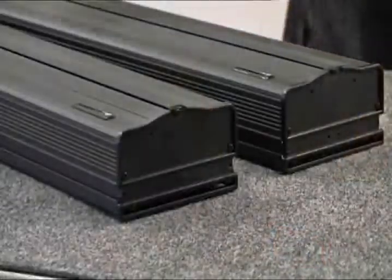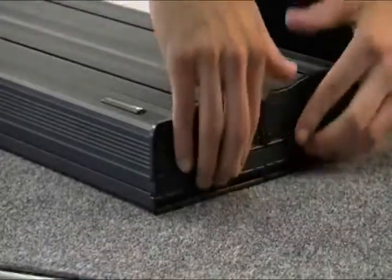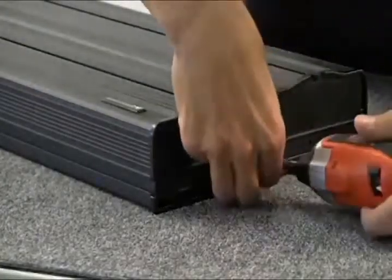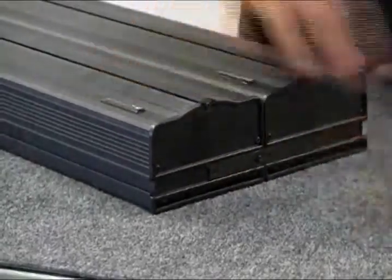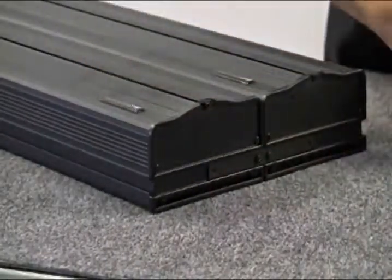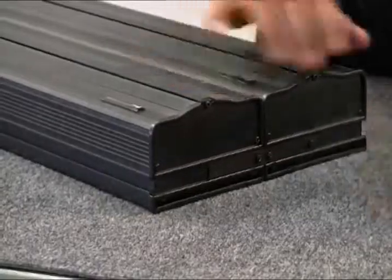After removing the metal attachments, place the fixtures side by side so that the lengths of the fixtures match up to each other. Start with the non-power cord sides of the fixtures. Take one metal attachment and route the piece between the metal attachment channels of both fixtures, matching up the screw holes so that the attachment overlaps the two fixtures. The left side of the metal attachment will align over the two far right holes of one fixture, and the right side will align over the two far left holes of the second fixture.